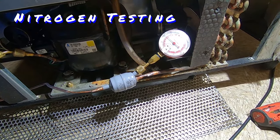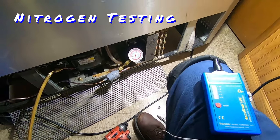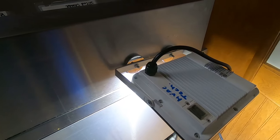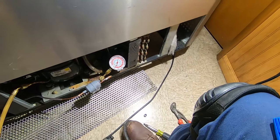It's filling up now and we'll check her out. We just scanned it with the ultrasonic leak detector—I did not hear anything. Pressure's not dropping. I'm going to go ahead and soap it just in case. Here's a little hack you can do: put your light tube, two magnets on it—that makes it so much easier and holds it wherever you need it.